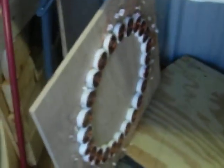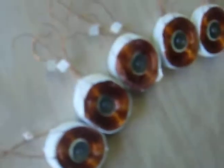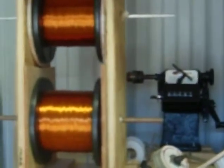I've got two sets done. There's 24 dual coils and each of the power coils is 300 turns of 28 gauge wire, and the pickup coil on the outside of that is 150 turns of 24 gauge wire. That's to start with. I use the coil winding machine up here to make this all happen. That worked good.